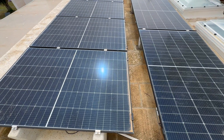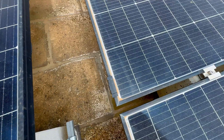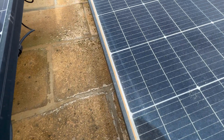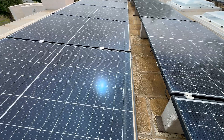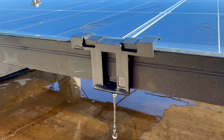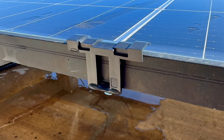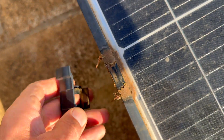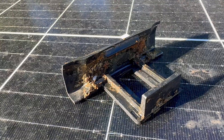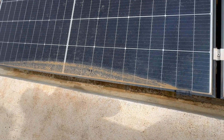On the portrait-oriented panels, the drains have done a great job. There's only a slight debris build-up near the panel lip — far less than we'd generally expect. Interestingly, I fitted just a single drain in one corner on one panel, and it performed just as well, if not better. You could argue it's more effective, because the area around both drains on fully fitted panels tends to become a new collection point for dirt, so fewer clips might reduce that secondary accumulation.